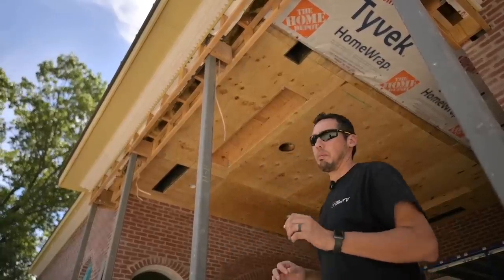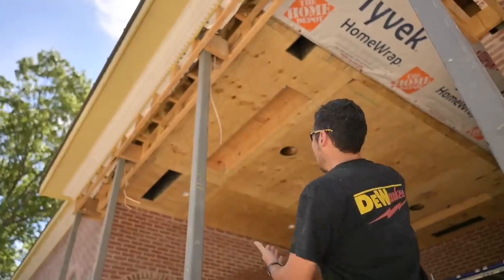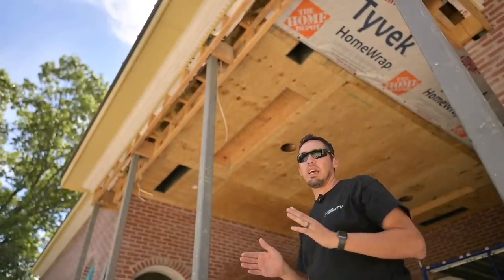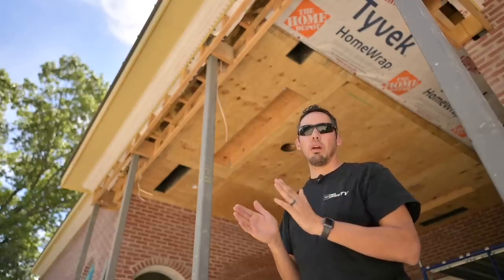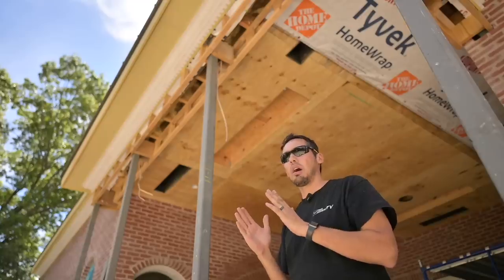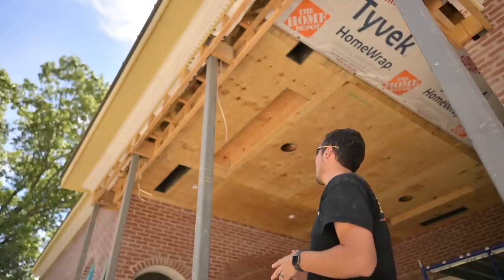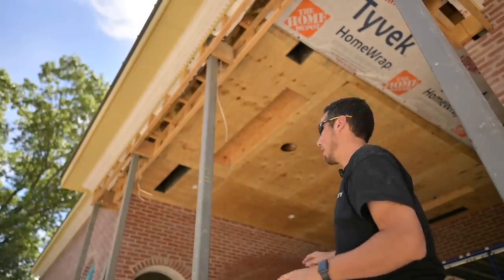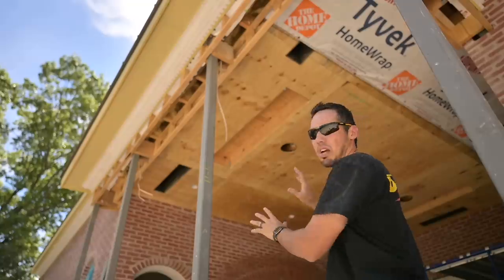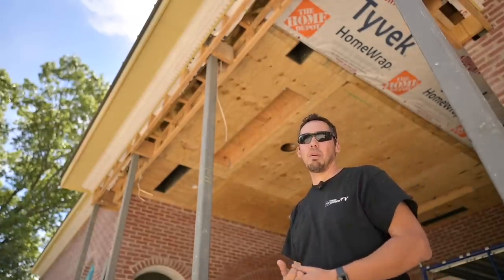A small problem came up that I want to tell you about — it's going to look a little different going forward. You see that rectangle right there? That's a rough opening for a heater, and with the coffered ceiling layout it's right in the way of where we need to put the beams. We spoke to the architect and he confirmed it needs to be compressed and made shorter. They're going to reframe it and make it smaller — we need some 2x12s for that which we don't have today, so we'll pick that back up tomorrow. We'll keep going with the vapor barrier and patch it up with sheathing and house wrap. These kinds of things happen and you just have to solve the problems as they come.